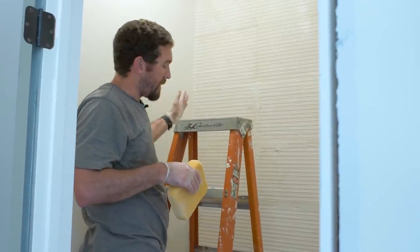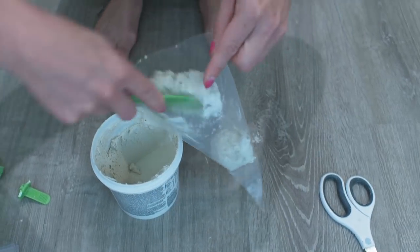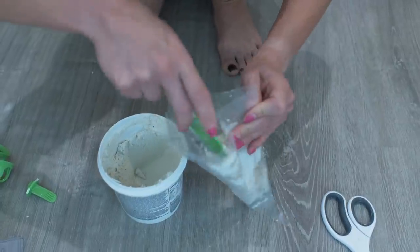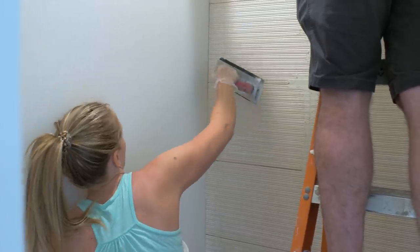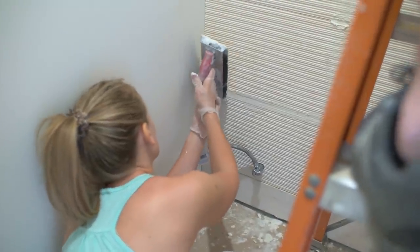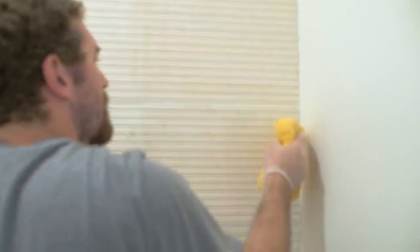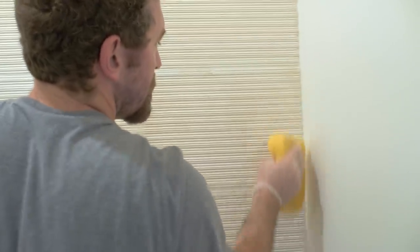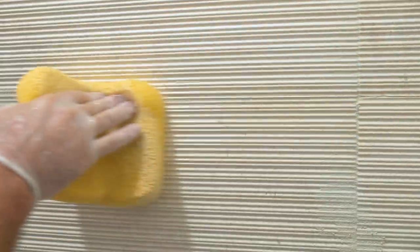For against the wall, it's going to be a lot harder to get the grout float in there, so I used something like a pastry bag — like something you'd use for icing — squeezed it into the corners, then came back with my finger and pushed it in. After the grout has a few minutes to start hardening up, you can come back with a wet sponge and wipe it out to get as much off from around the grout lines as possible. Then clean with a very clean wet sponge after every couple of wipes to remove that haze from the tile and reduce cleanup.